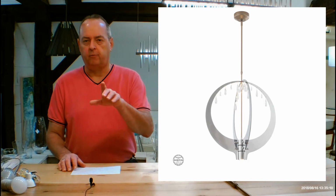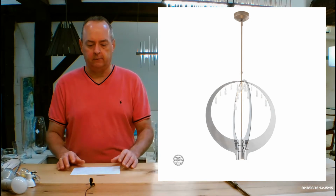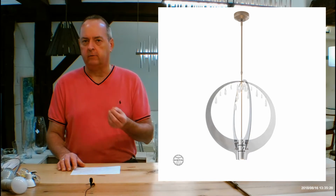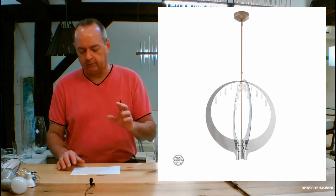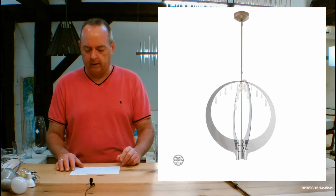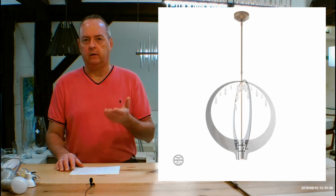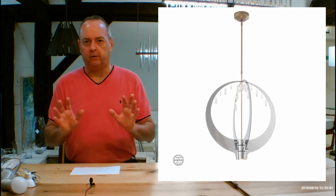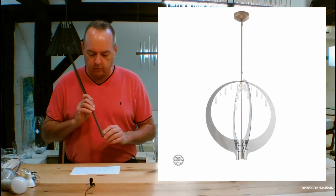Well, before we go there, the bottom of this has to be in chrome, because those little hangers are actually being energized from a low voltage charge from that chrome fixture itself, and that chrome is carrying the voltage itself. Really low voltage, perfectly safe, all that stuff. But if you had put a powder coat finish on this, it would act as an insulator, and it wouldn't allow that little hanger to be energized. That's why the bottom has to be just a plated finish, and it can't be in the 10 different finishes that we're going to go into in a second.